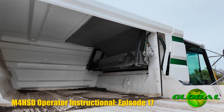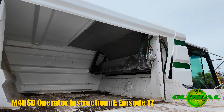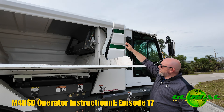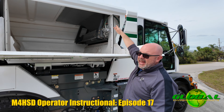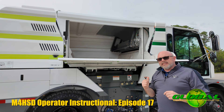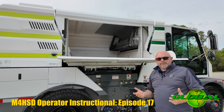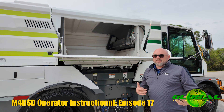The material hits the back wall of your hopper, slides down, and starts packing the hopper from the rear to the front. There is also a speed sensor on that load wheel device. As you pack the hopper out and material builds up against the load wheel, your hopper becomes full. A buzzer and a light will go off in the cab displaying 'load wheel stall' — that's your hopper full signal, telling you there's no more room and it's time to go dump.